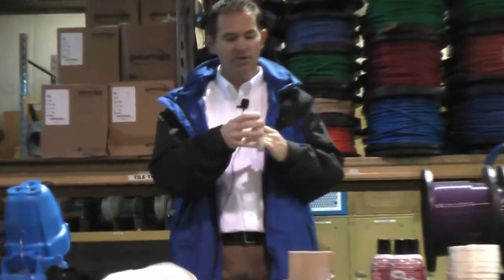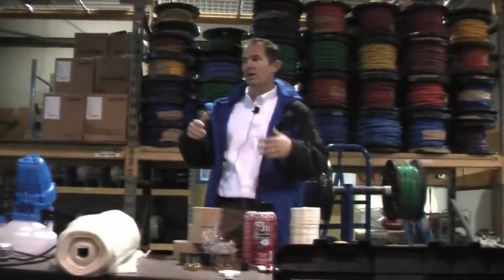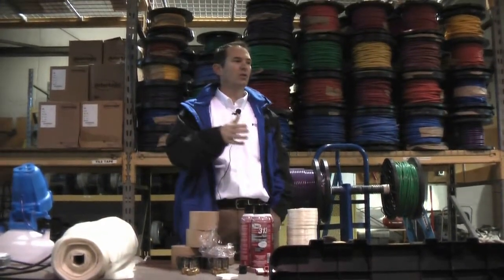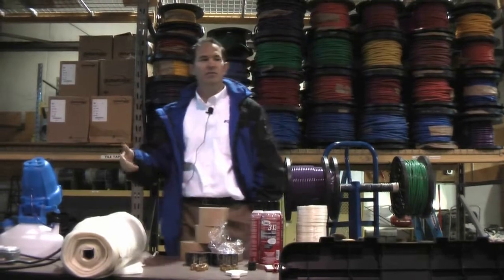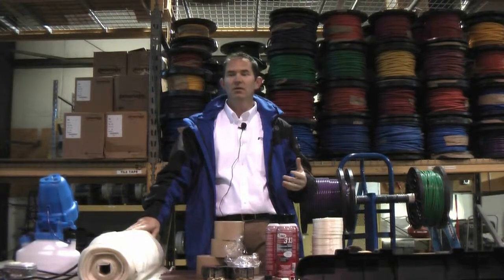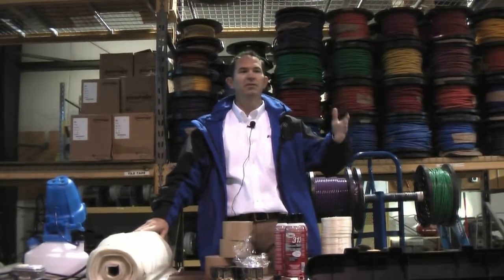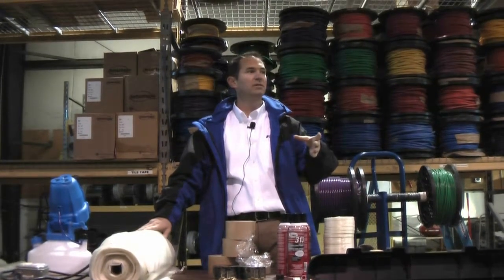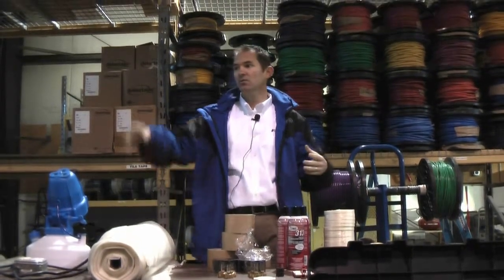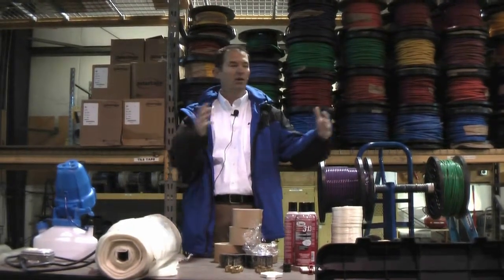This is a strapping tape — it's a fiber-reinforced tape. So when we're doing large vents and we have inclement weather, we always seal knowing that we have to hold that seal for sometimes 48 to 72 hours. We're doing a 24-hour exposure, but within that time frame we have to prep a facility before they shut down and entirely out before we release the gas. So we're preparing that facility to sit for maybe 72 hours. We'll use that fiber-reinforced tape to go around the bottom to help hold that on vents.